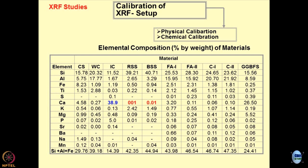Calcium is the most important thing in most of the geomaterials. If you take Israeli chalk, which I was talking about yesterday, the calcium present is extremely high compared to any other material in this series — this is a naturally occurring source of calcium. If you look at GGBFS, you will have a very high value of calcium at 26.5, which is man-made. Once you have understood the strength of the material, you can utilize it. If I want a material for a situation where calcium is required, I will be adding GGBFS to this — this is one of the strategies.